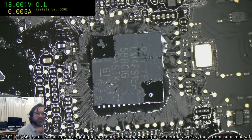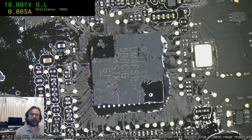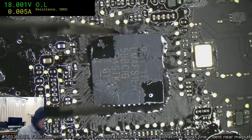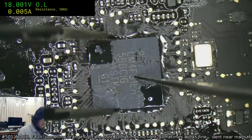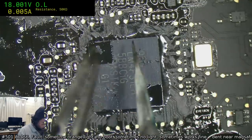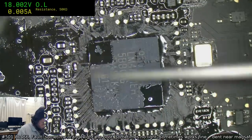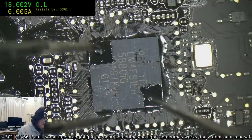Hey, NW. EMC squared. Yeah, I used to use paste all the time, and then I found that for the SMCs, for anything pretty much above 0.3, I had a preference for balls over paste. So in the end, it just comes down to the personal thing, of course. And I also like having this single side, this tweezer that I've split in half. Excellent for when you want to pin something down.